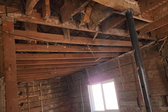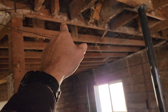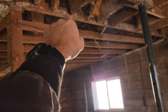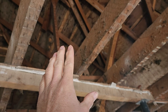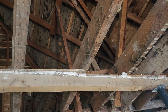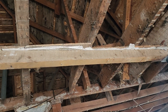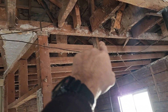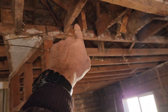When I run my beam down here I'll have to get rid of all the nails on the bottom of the boards. I might be able to set my beam right there, and that 2x4 that braces the ceiling up — see how it's braced up there — because it's a wide open roof without normal trusses running across. I might be able to just run my beam right on top of it and anchor it to the truss.